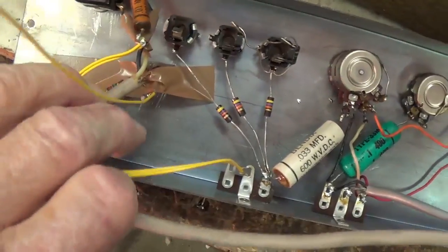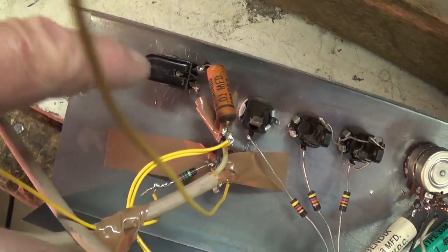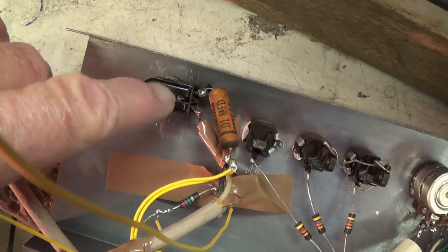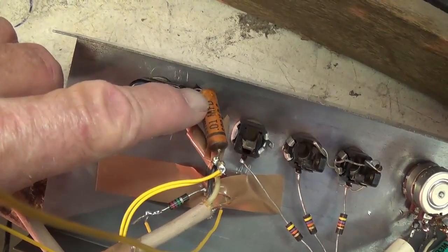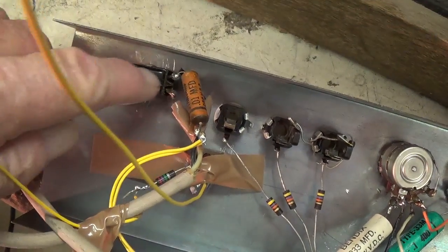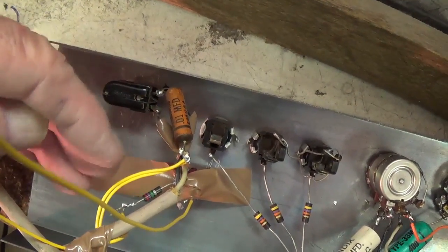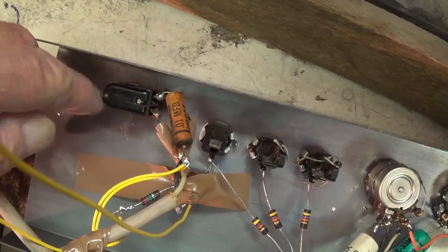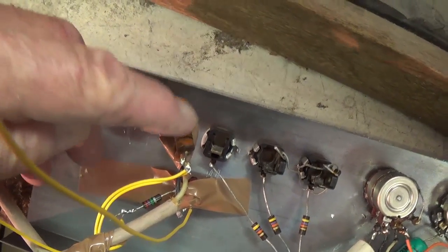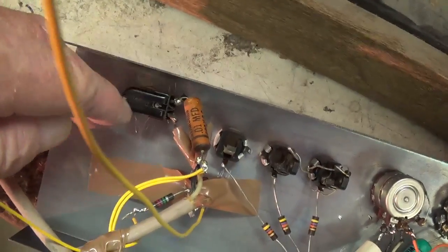Well, I pulled off the control panel and flipped it over, and you see that type of amateurish wiring that starts to make you nervous. And looking at the scratches here and all that, I have a feeling this is a bright switch, because look here, 0.01 microfarad, and it goes to ground. And I'm thinking when you have it in the on position, you're going to get your really deep, murky bass tones. When you flip the switch off, then you'll be preserving your high frequency. So it's sort of like a bass switch, I guess.